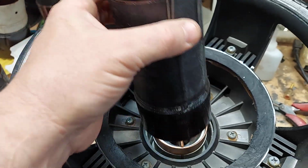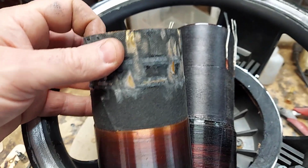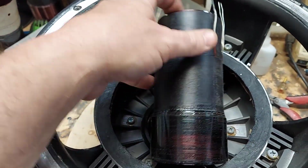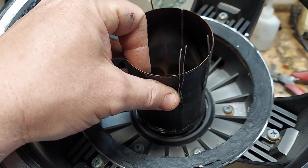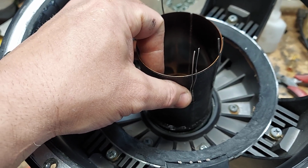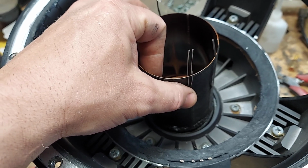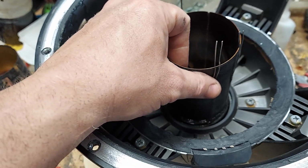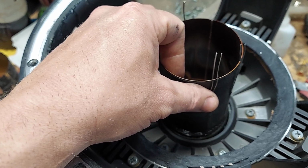Okay. The other downside is that you need a little bit of an extended former to reach where the cone reaches. So, and because mine's super long, I can do it with this one. So this is the one that's going to have the OD that looks really nice on it, which is good for, again, it's not necessarily that you want to fill the gap because of more windings. It helps, yes, but most people wire in parallel, so you know, again, you stay at 100 windings. But in this case, we like it because we're going to heat sink.